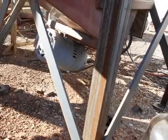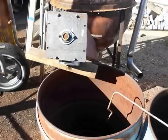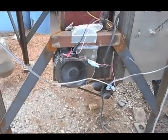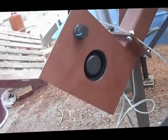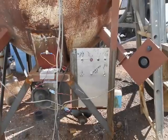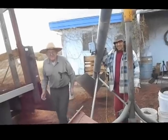Here's a shot of the bottom motor on the auger delivery system that takes the finished biochar from the gasifier up into that 55-gallon drum. He uses computer fans for his air distribution system, using a very low amount of electricity — here's a dimmer switch. These fans feed air through tubes into the bottom part of the gasifier digester. He can adjust those fans for the amount of air needed for good combustion.